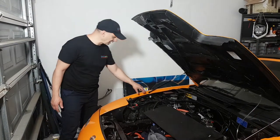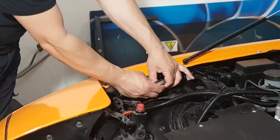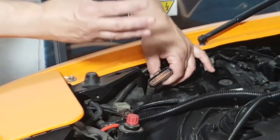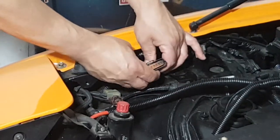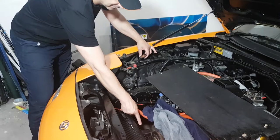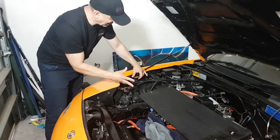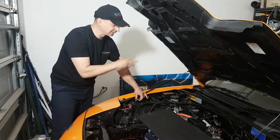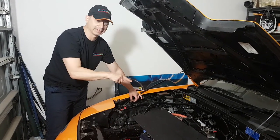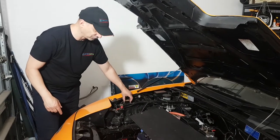I've tracked the taco cable back to this plug here. This is the original receiver unit so it should drive the MX-5 taco pretty easily. I need to get cable from here up around and into this plug — I'll probably cut it here. The way the taco works is there's a counter within the taco, so I need to be able to get pulses to it each time the motor turns.